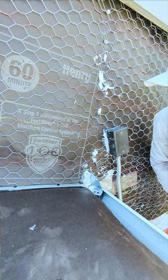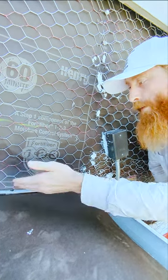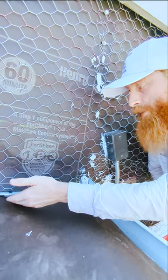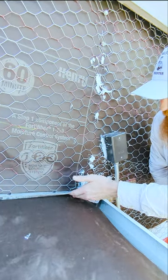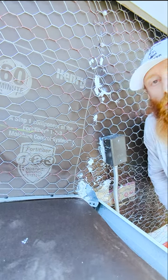Now, that's how it should look. You put a metal diverter underneath the step flashing so that any water that goes off this roof into the step flashing hits that diverter and goes into the gutter where it belongs, instead of going into your stucco wall.